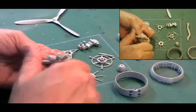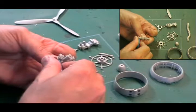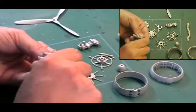With this scraping technique, if you take your time when putting this together you might be able to almost eliminate all of this sort of flash. What we don't want to do is get in here with a file and flatten it off, otherwise we're going to end up with a flat spot — we want the ribs to show through. It's just one of those fast but quite easy jobs to do.